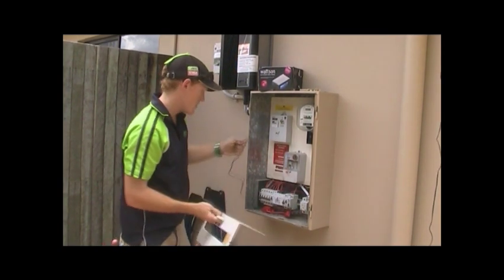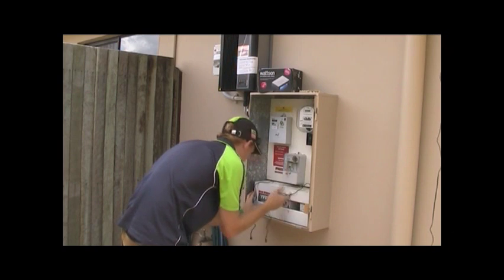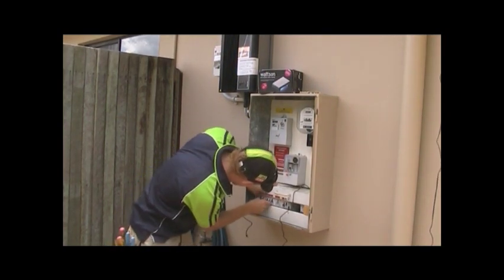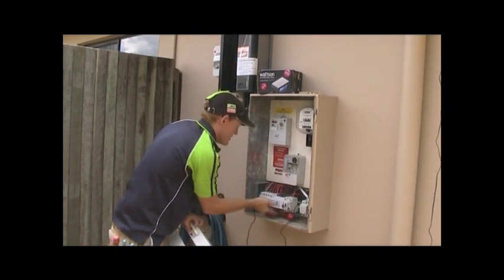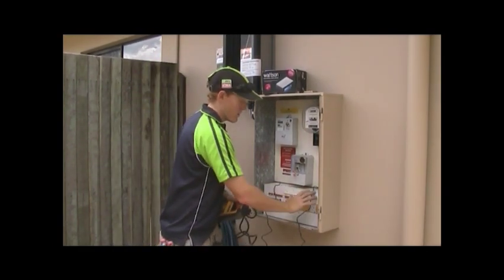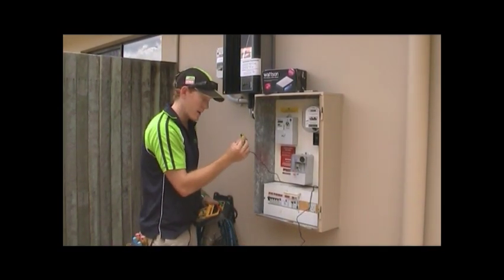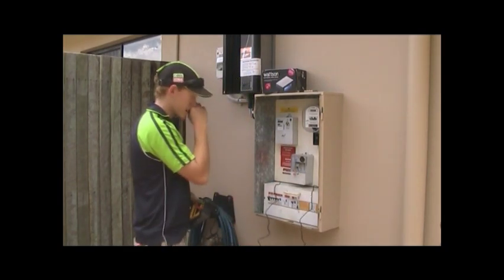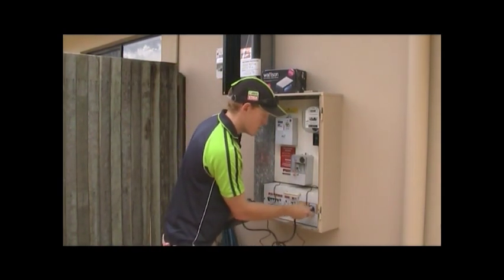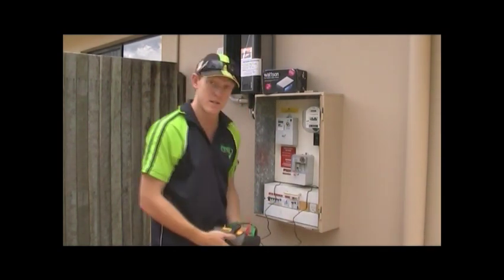The next step, while the power is still off, is putting back on our cover panel. So what we've just done in that short break was put our panel back on — obviously before we tightened our screws to make sure everything was okay. We've now got our tails just hanging out here: we've got our AC power and light, and we've got our solar supply main switch. We've now turned back on the house and all the circuits, and our last test for the switchboard is a safety switch trip test. We simply trip that, and it trips the safety switch — so we know all our electrical installation is done correctly and to standard.